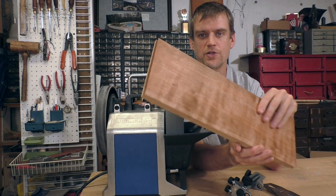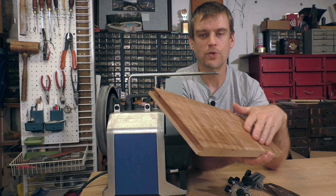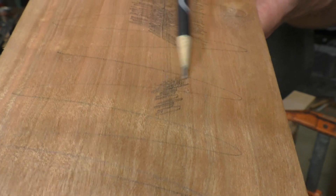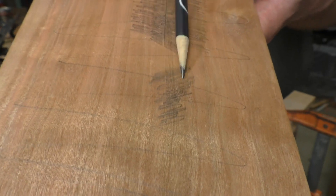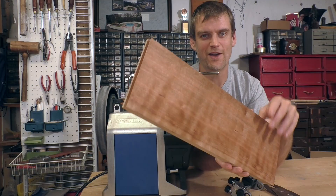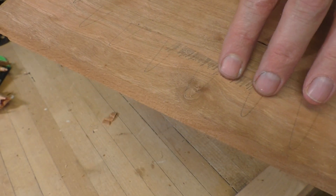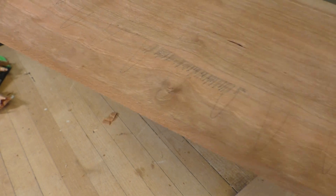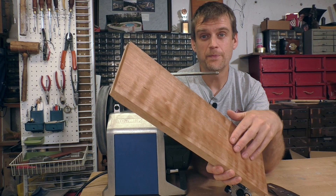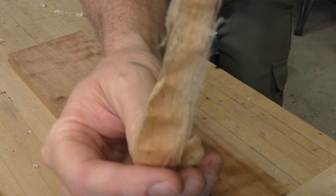But with a straight blade on the surface of a piece of wood, often what you might have is that the corners of that blade will dig in just a little bit, depending on how thick of a shaving you're taking. So as you plane across, you'll end up with little tiny ridges where the corners of the plane blade are taking shavings. Cambering a plane blade will essentially get rid of those sharp corners, so it feathers away at the edges of the plane blade.